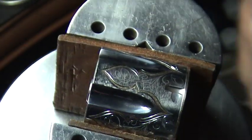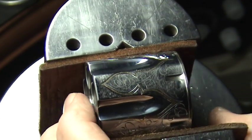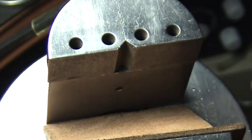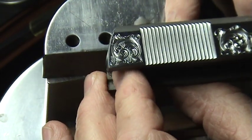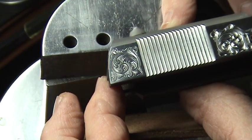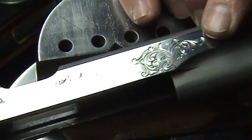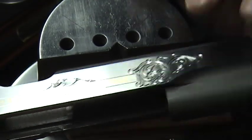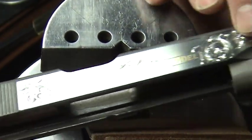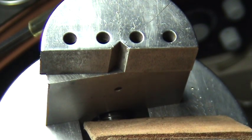Now in this case I've used a transfer plate, a master plate, but just to demonstrate something else I've been doing today with another Colt automatic firearm, a single action 1911. I laid out a pattern here on the rear of the slide. I reversed it and used it here to lead in my letters, and then I did it again here and added an additional flourish here, but I've used the original image once, twice, and three times and eliminated a lot of layout time. So that's my quick and simple way of transferring using chapstick and 3M magic tape.